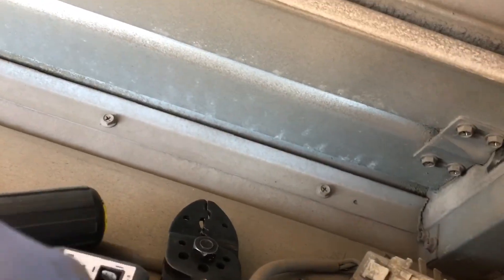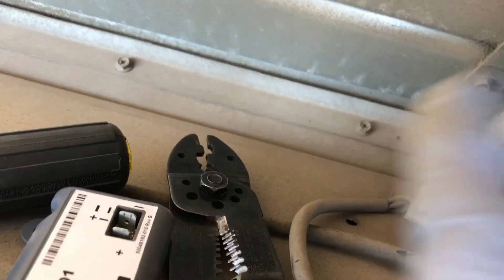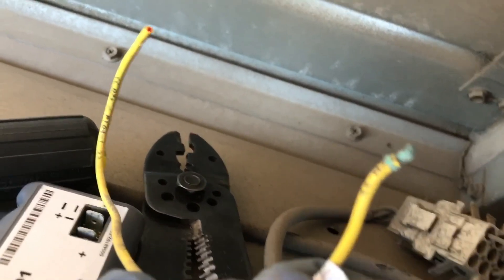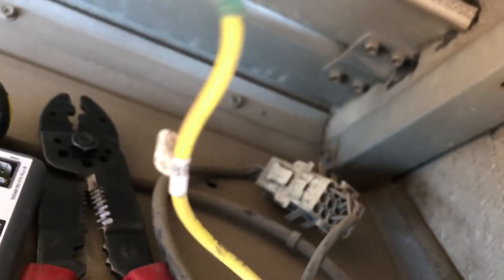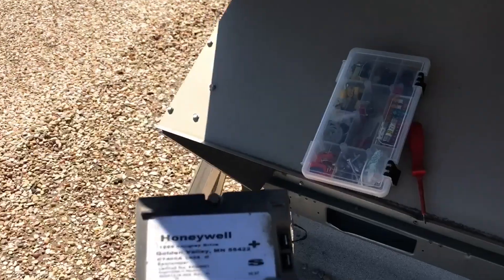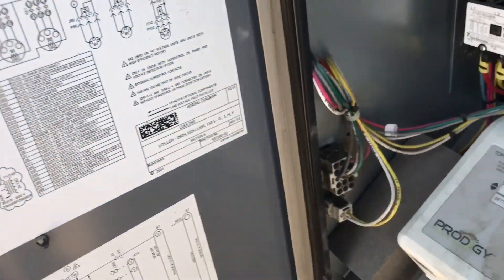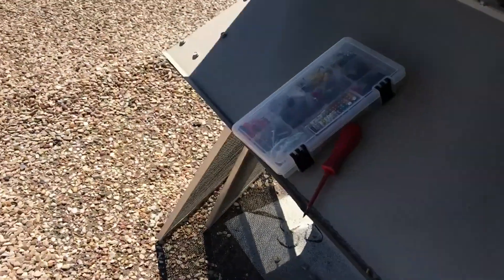Well crap — I went to install this new sensor and I had to put new terminals on it because the old ones didn't fit. This won't fit into that jack. I was pulling the wire to strip it to put my new terminals on it, and the wire came out. Look at the plug — it's all corroded inside. I guess they have a backup sensor now because this one's probably still good, but we'll go ahead and put the new one in and fix the wire.